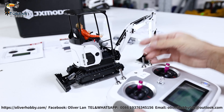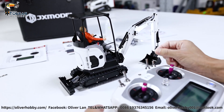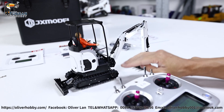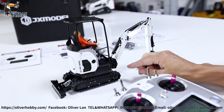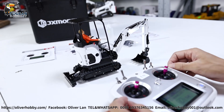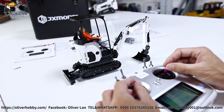Please understand: for the small cylinders, it is not 100% oil sealed. You will see the big arm and chassis dropping very slowly, but it's understandable. It's dropping very slowly and does not affect the operation smoothly.